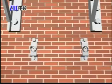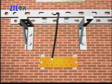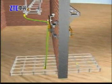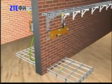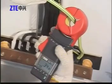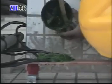Install the outdoor copper grounding bar and configure the combined grounding method. Fix the outdoor copper grounding bar on the wall near the outdoor cabling rack. Connect the grounding cable of the lightning arrester and grounding clips near the equipment room to the outdoor copper grounding bar. Find the grounding points of the base station grounding net and remove any rust. Lead out grounding cables from the indoor and outdoor copper grounding bars respectively and make the connections. Weld every grounding cable to the base station grounding net at separate grounding points. Do not connect the indoor copper grounding bar to the outdoor copper grounding bar. Use a ground resistance tester to verify the combined grounding resistance is less than 1 ohm; otherwise modify it. Perform anti-rust treatment on the outdoor copper grounding bar and base station grounding net.